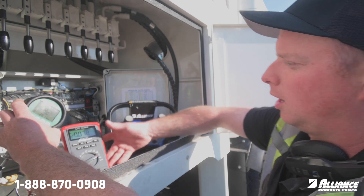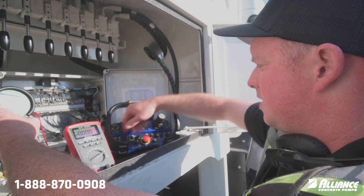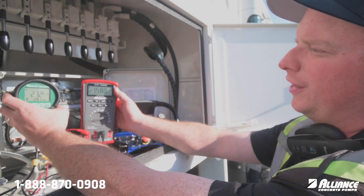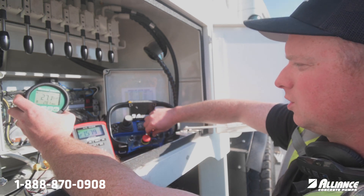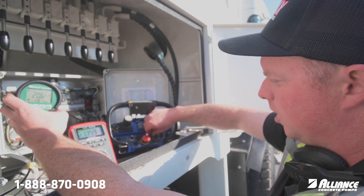So you want to see, if you're doing any troubleshooting, that at maximum speed we have no pressure. And then as we bring that current or that speed down to slow it, we want to see our current and our pressure react the same in a nice sweep. Just watch those pressures and see what's going on.